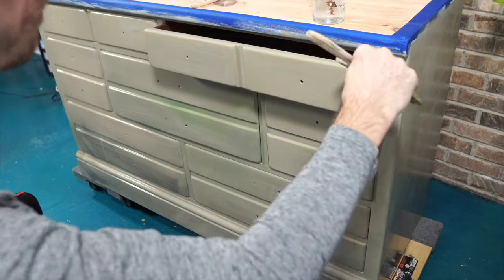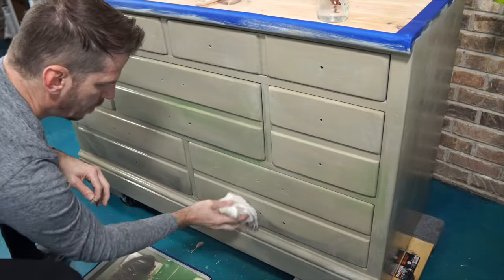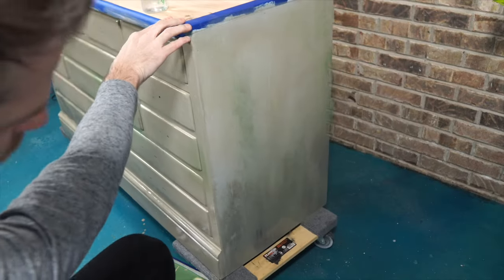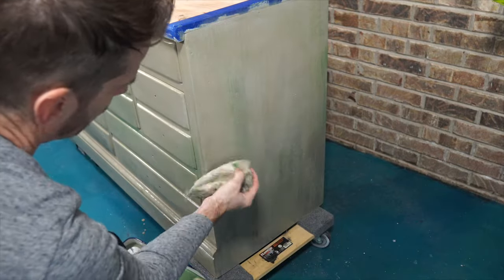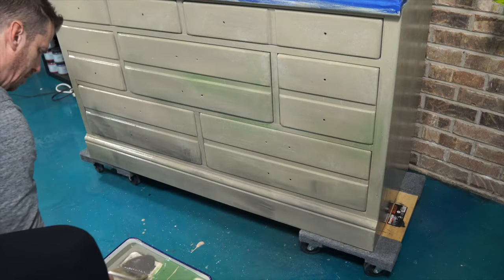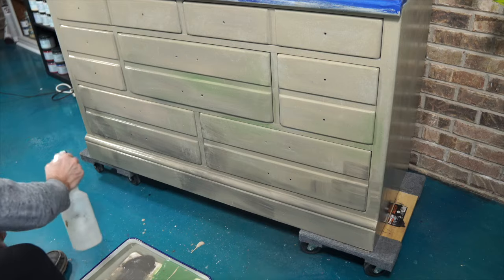I'll go through and pull out each drawer, paint the top lip, and make sure they all match. Then come back in with the rag to start adding a little bit of visual texture — not really anything raised that you can feel, just breaking up the brush strokes and adding depth. Add as much as you like. Then I come back with the squirt bottle and give it a slight squirt to add a little water texture; it leaves little spots. The under color underneath everything was driftwood, so that's going to show through. I want the base to be a little darker than the top — that gives it a good foundation overall.